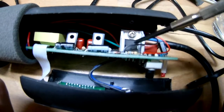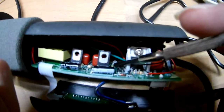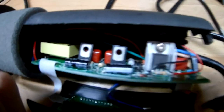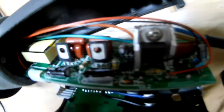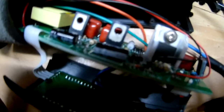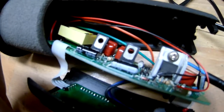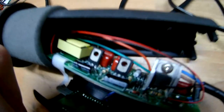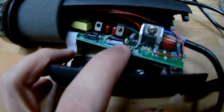Something back here - this gray thing is a resistor and it's missing parts from its coating. Initially I thought it must be a bad resistor that just lost its color, but recently I thought: what if the bang was the resistor? I didn't see any scorch marks around it, so I decided to take it apart again and measure the resistor, because everything else on here just seems fine.